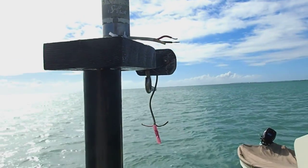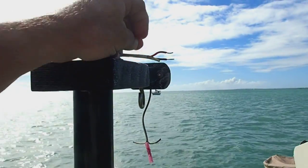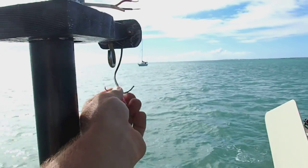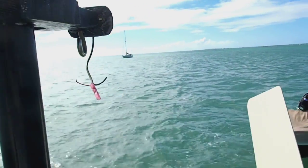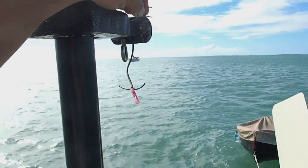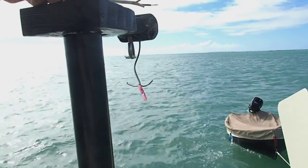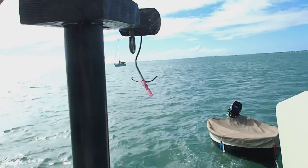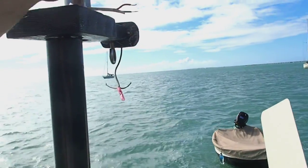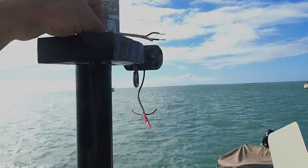Well, it turns out this is not so simple. Tested this out last night, and when I had it all connected there, I only got a very dim light, and it turns out there's hardly any current coming from the battery, so I'm pretty sure this wire is bad, so I'm going to have to pull the wire out and replace it. First I have to get more wire, so that's on next day delivery from Amazon. So we keep going at it here.